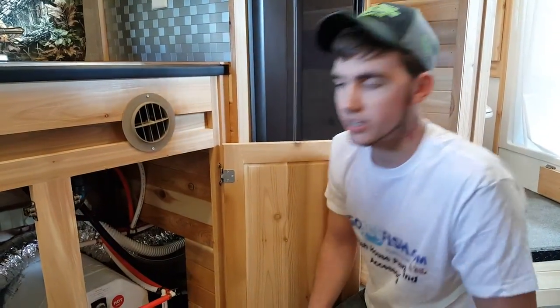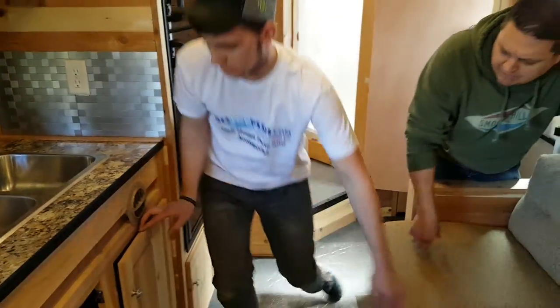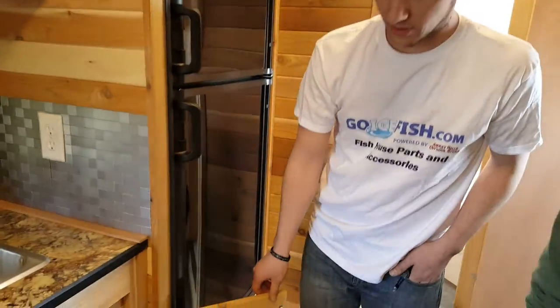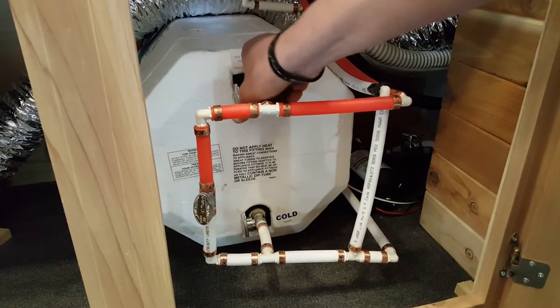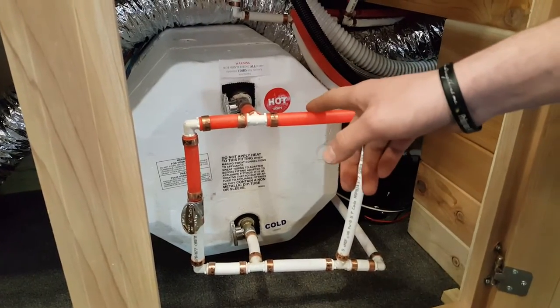You know, go camping for the weekend. I'll show you where the water heater switch is. But before we even do that — if I'm going to winterize, I just want to do the opposite? Do the bypass? Exactly. We want to have the bypass open and the other two closed before any antifreeze gets into the system. We talked about it outside — we don't want antifreeze in the water heater or we'll get that taste.